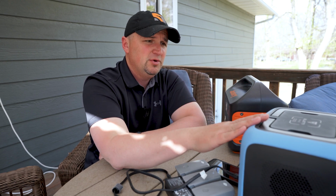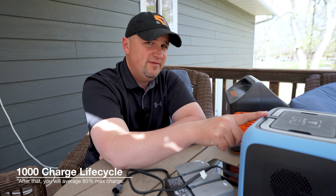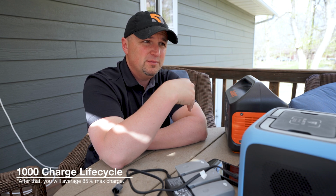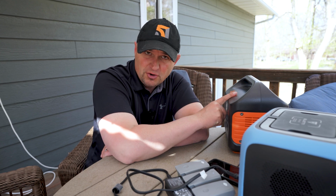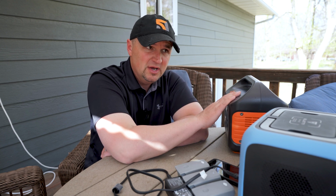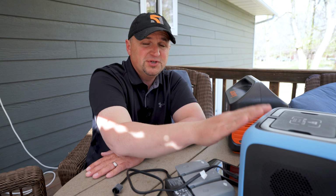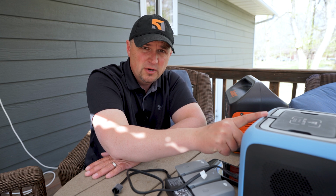But here's the thing, the Bluetti AC50s has a 1,000 charge life cycle down to 85%. So that means after 1,000 charges, you're only going to get it up to 85%. The Jackery only has 500 charge life cycle, and that brings it to 80%. So you're getting twice the amount of usage out of the Bluetti than you are the Jackery. You're going to be able to run bigger things with the Jackery, but you're going to get more usage over the long term out of the AC50s. So I think for your dollar, the AC50s is the better option.